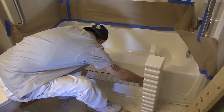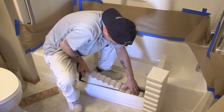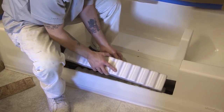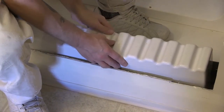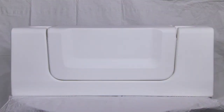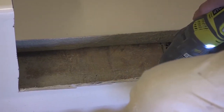Once the SureStep product has been cut and a satisfactory fit into the tub opening has been achieved, it will be necessary to assemble the support box structure to provide support to the product. The support box structure consists of one small and one large support box. The large support box will compress over the top of the small box to the necessary height. If you are installing a SureStep Combi, a waterproof membrane will also be applied to the open cutout channel once the support box has been properly positioned. Each tub has variations and modifications may be necessary depending on the flooring, height of the tub, and other factors.